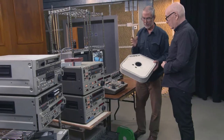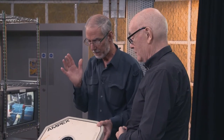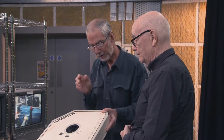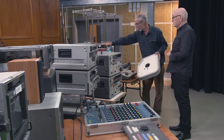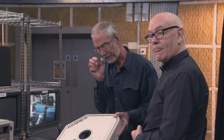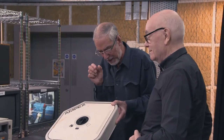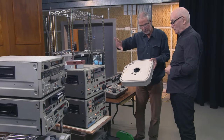You looked at where to cut; you had a stuff called Eddiview which was a solution of iron filings in a horrible, alcohol-y, spirity liquid, which you would put on a cotton bud. You would play the tape and stop it where you thought the cut would be. Put a little chinagraph mark where you thought it was going to be, take the tape, put this little Eddiview on, look for the control track — which was a signal indicating where the vertical interval on the signal was at the top of the screen — and you would cut there because that would cause less damage than trying to cut in the middle of a picture. You could then see it with a microscope and when you got it right, you cut with a very sharp razor blade down the two tracks, and that would give you your out from your recorder.